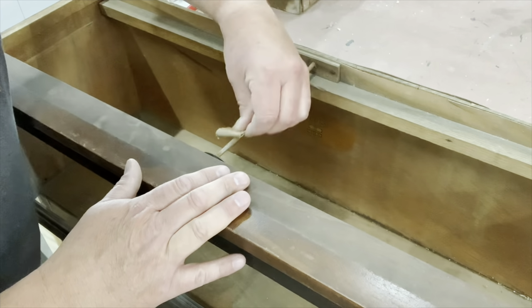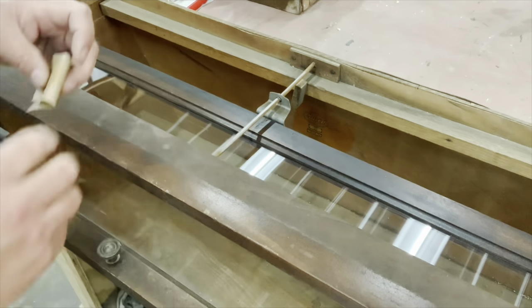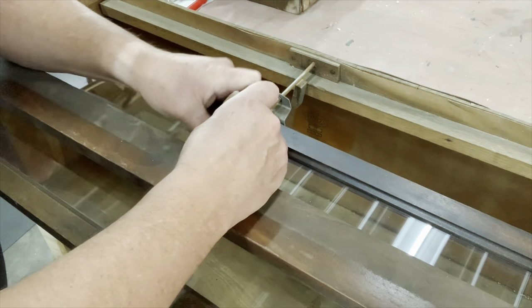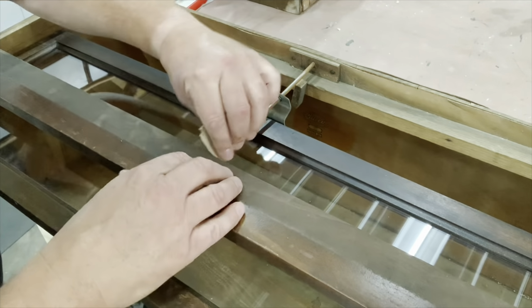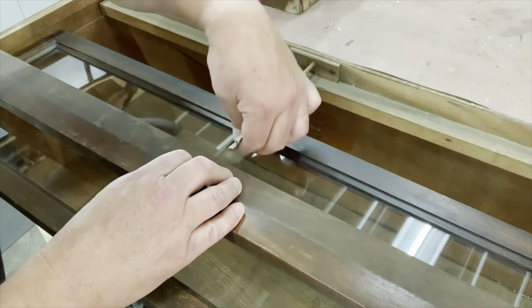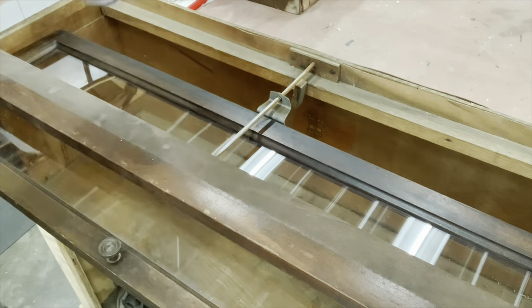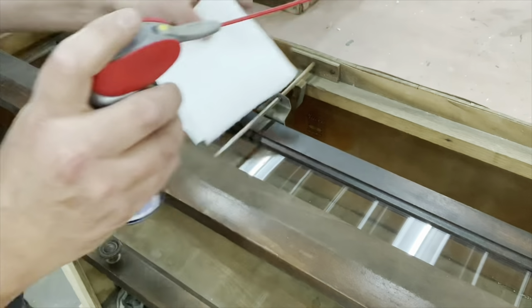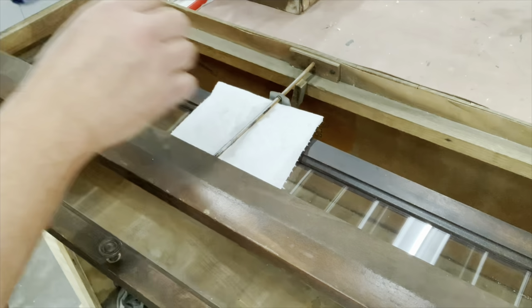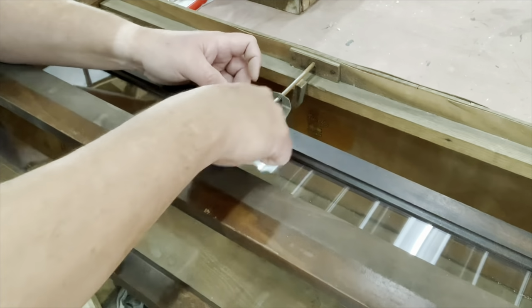First he's working on getting the doors to open and close. It's been out in the weather, probably in a musty area, basement, shed, barn, what have you, that has built up condensation on the metal, and the metal has rusted, so it's not making it glide so easily. So he's taking some sandpaper and sanding that rust off. And now he's going to add some WD-40 to hopefully make these slide in easier and open up, because this will really be a waste if you can't open and close the doors.